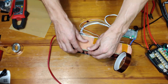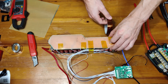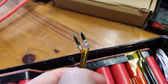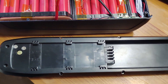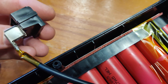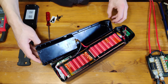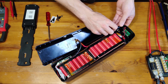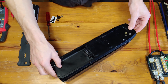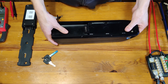Just placing a bit of insulation in between the fiberglass sheet on the sides. Now I'm closing everything up with Kapton tape. These are the connections to the outside of the battery — I've split the terminals into two to split the power, done this with both the positive and negative. After everything is connected we can test fit the battery inside the box. Make sure you don't pinch the cable or wire while doing this, and in our case everything fits — just very snug, but it fits.